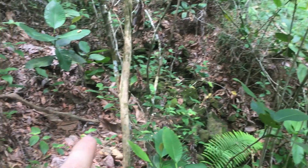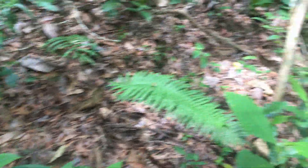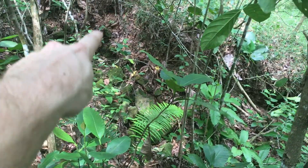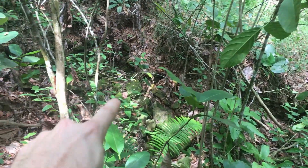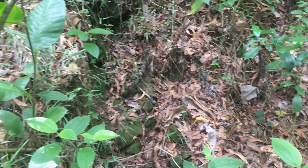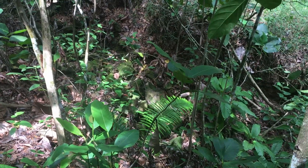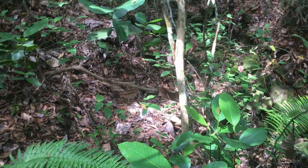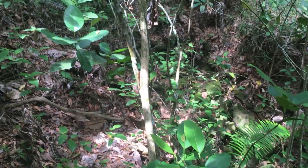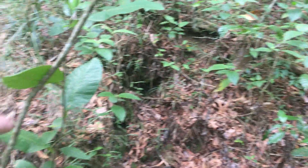I can plant it on these rocks here and potentially do a rough bench cut through here, reinforced with the rock that's laying around — across this area above this tree. You might not even need a bridge; just pile up these rocks and that won't wash away — it'll let the water continue going through. Then we come across and this section here, it's about a two-foot lip that we just bash out. Sections like this you really have to look at what's here, use your imagination, minimize impact, and use what nature has given us and manipulate it slightly to work.